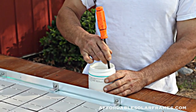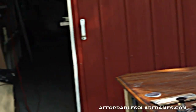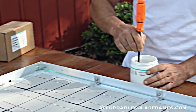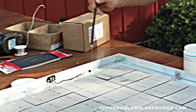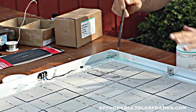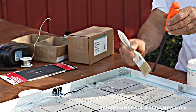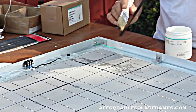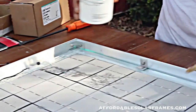After that, my barn faces south so I can open the big door and leave the panel in the barn with the sun shining on it and let it heat up. I won't put it on my array for a week or two. If you try to put it on there too fast, this stuff sets to be sticky and the cells may slide off — especially when installed upside down in the heat. Just give it at least a week.